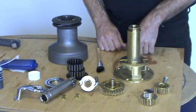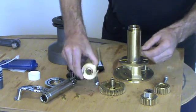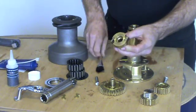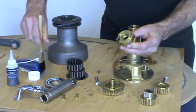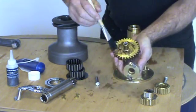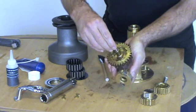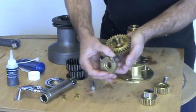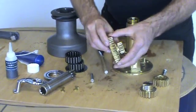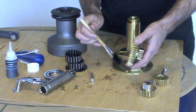Now we're going to reassemble the winch. We're going to re-grease, service, and check for wear on components. The pawls are only oiled and we grease everywhere else. Check this bearing is correct and not a loose fit — change as necessary. Re-insert the gear package back into the centre stem. Lightly grease the base where the gear touches the centre stem.